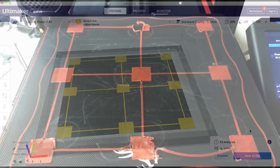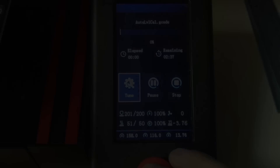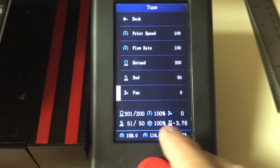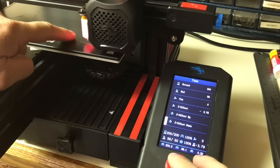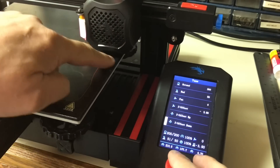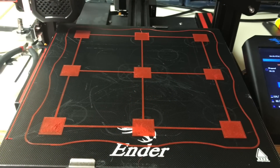I sliced the file, put it on an SD card, and here's the result — not really what I expected since I based my Z offset on just sliding a piece of paper, so let's fix that. Once a print starts, use the tune menu to live-adjust the Z offset: click tune, scroll down to Z offset, and step it up or down. I rub my finger on the bed and step it down to get it to stick better. After the live adjustment, the results are improved — not perfect, as the left front corner is still a little off, but overall a pretty even print with the auto level.